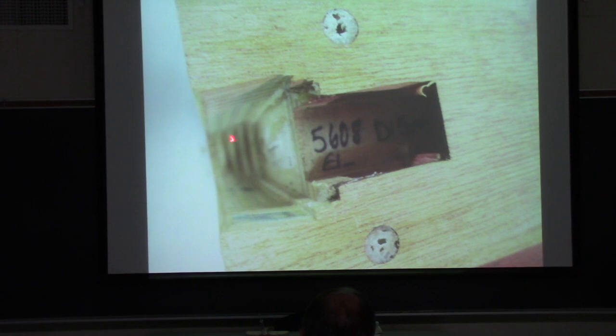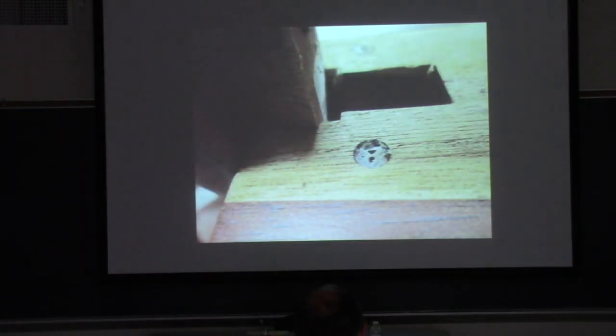Yes, and here's another shot of that little part here that I'm talking about. You can see it right there, riding along there. I know when I did my first one, I was trimming the heel, and I wasn't getting it in. I was like, what's holding it up? And then I realized that it was that little part right there that was creating all the goofiness. Here it is now. So now you can really see what I'm talking about. So here's the end of the tenon. You see how it's contacting right there? That was the issue that I was having.